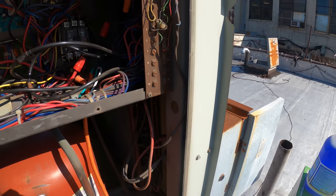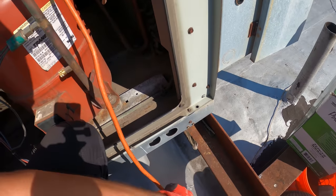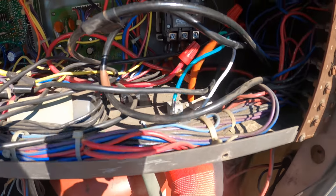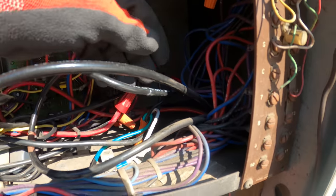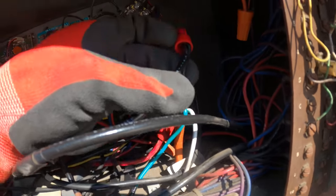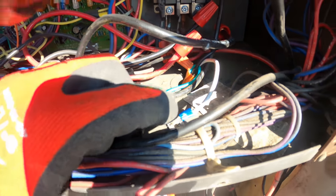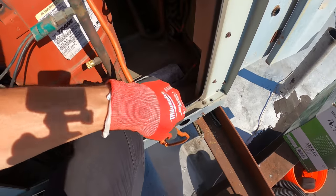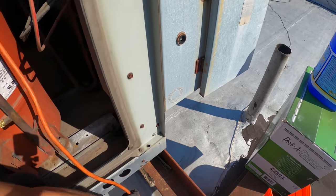There are no outlets nearby, so here's our disconnect. This is a three-phase unit, so here are our three phases. What I did is cut up an extension cord — I disconnected the three phases coming into the contactor, took one of the legs so we have 115 volts, put it to the black wire on my cord, and grounded the white wire right here to metal. Now we have a 115-volt circuit to power this up without sending power inside the unit at all.